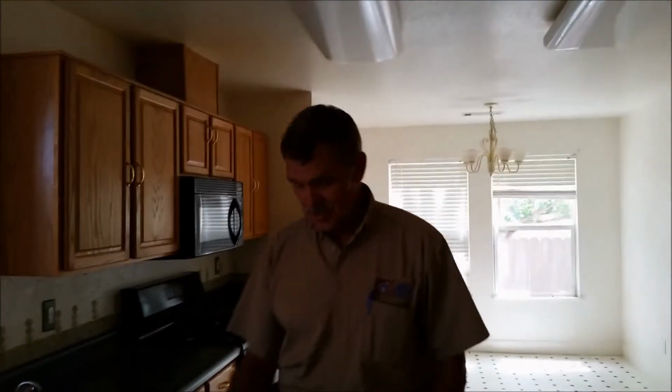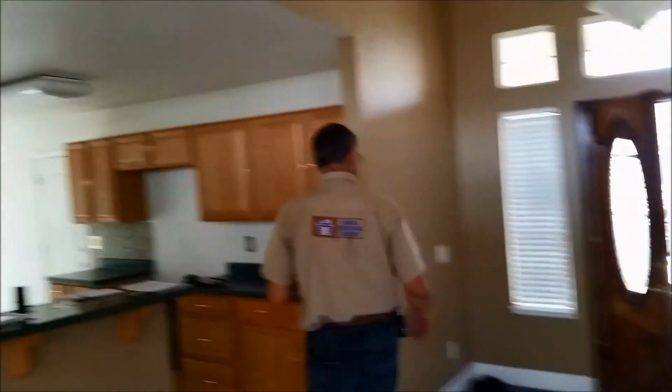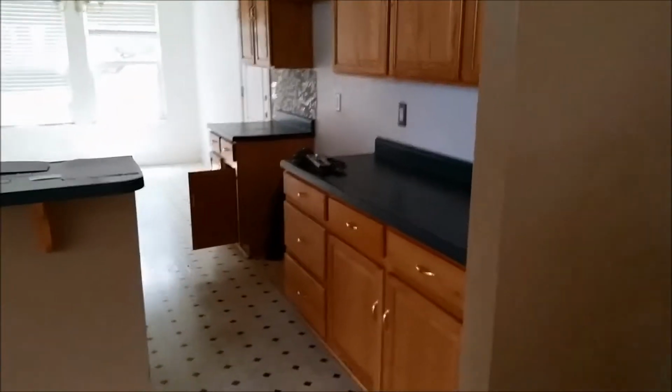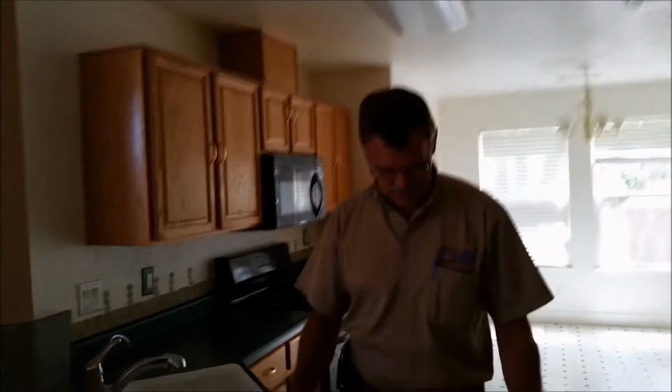We did have one, and I'm going to call it a typical settlement frame shrinkage crack. Dave, if you just follow me real quick. Straight line crack starting at the fan in the living room, straight over to above the fireplace. Right on a tape joint line. I believe that's just a typical settlement crack, not a structural issue. Let's see, kitchen. Disposal wire is loose for the garbage disposal. Countertops look good, cabinets look good. Crawl space was nice and dry.